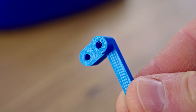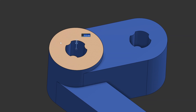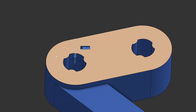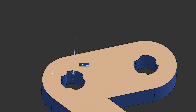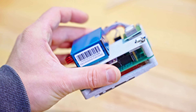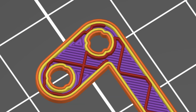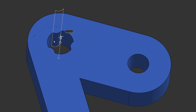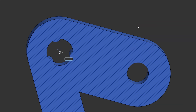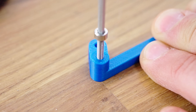Next, the new one — let's call this one a self-forming thread. I'm probably not the first one to come up with this idea, and it's a pretty logical approach. I needed something for these mid-frames of the sensor box that would require no specialized tools and would still easily print on any 3D printer. In function, this is very similar to the straight untapped hole, but it reduces the cross-section that the screw has to deform down to just three individual ridges.